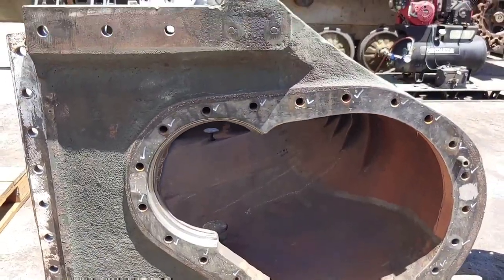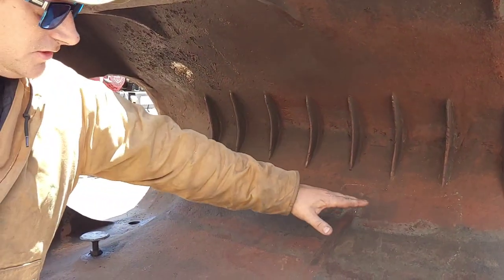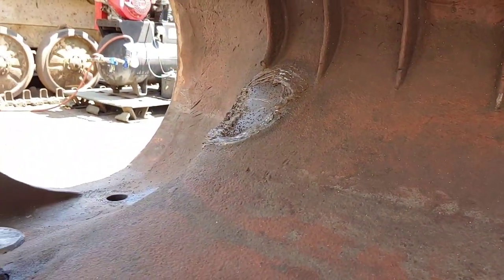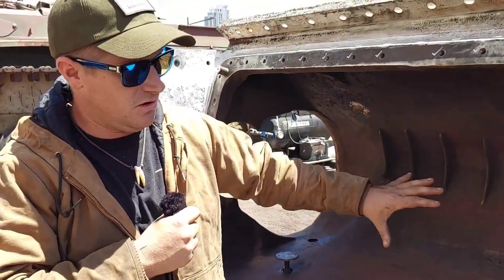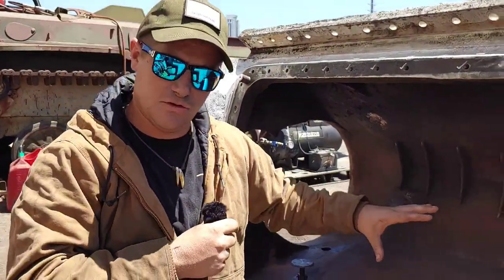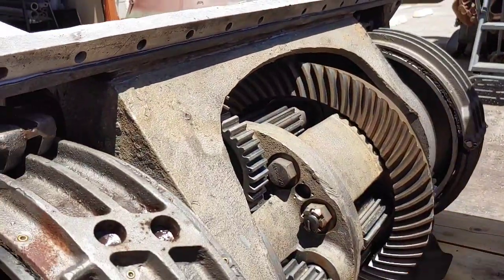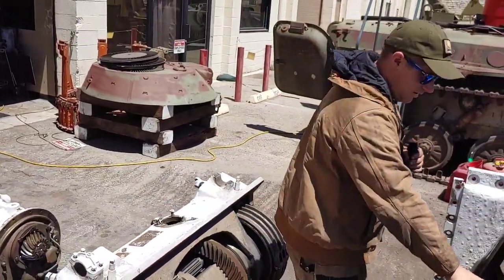This whole entire section from inside here all the way back to the gearbox is an oil bath - so it's not pressurized. Your oil level - you can even see the line there - sits about this high, and then once the transmission is spinning it's actually throwing oil all around the transmission. This section of the front end shares its oil level with the gearbox.